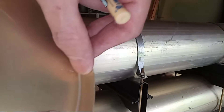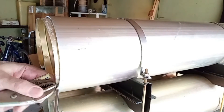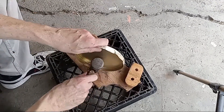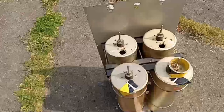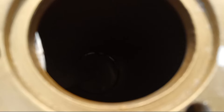They were very tight and quite difficult to remove. I ended up prying them free from the bottom, but I ended up bending up the bottoms, which required some body work to pound them back into shape. I later realized that a long wooden dowel or a broom handle inserted into the resonator through the coupling loop opening in the top would have ejected the bottom covers much easier.